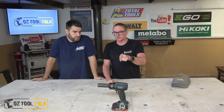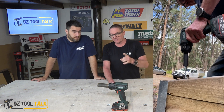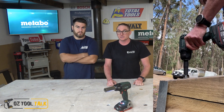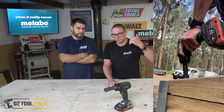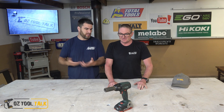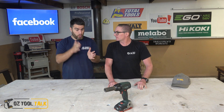I often look at it and go, what do I want an impact wrench for? This is so close to the size of an impact driver — I could justify having that in the back of my ute, no dramas. The dial is probably something that people would look at and go, oh, it's a bit old school — but stuff, it's awesome. I don't need a full licence and a university degree to work out the buttons and what mode I'm in. It's got really good increments. You hold it down and flick through at about 200 RPM per step. Maybe the top speed is 2150 and the bottom speed might be around 300 RPM, and it just goes up really consistently.